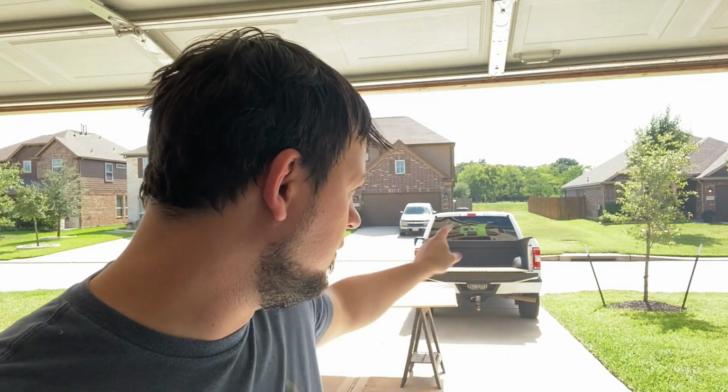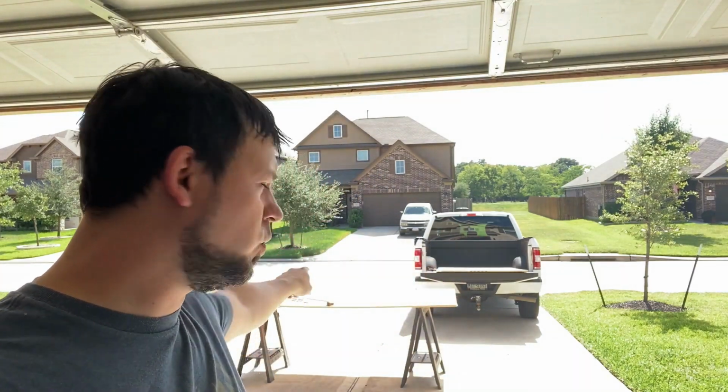As you can see, I've got a sheet of MDF in my truck as well as one on my sawhorses. I also have my slats of pine wood molding. Hopefully you have those materials as well as the tools I specified in my previous video. The first task is creating a side panel. It can be whatever shape you desire, and the reason for that is you can trace your other side panel from that original cut. I prefer my cabinets to be around 6 feet tall and about 24 inches wide within the cabinet. So that's basically what we're gonna aim for.